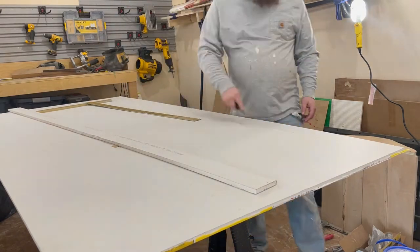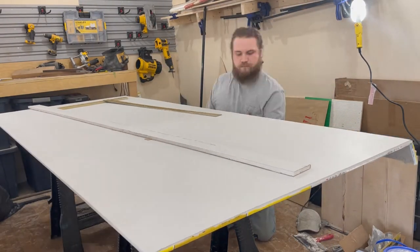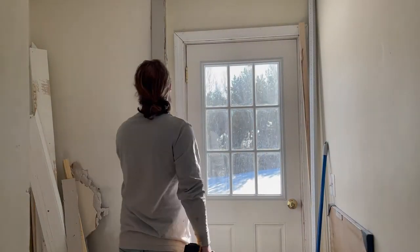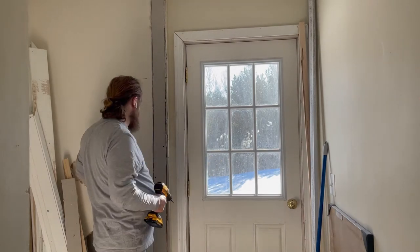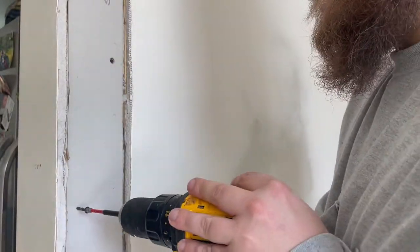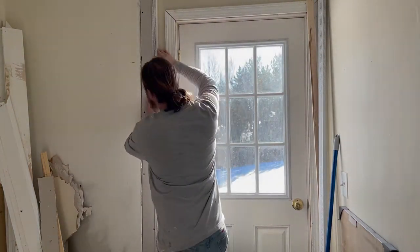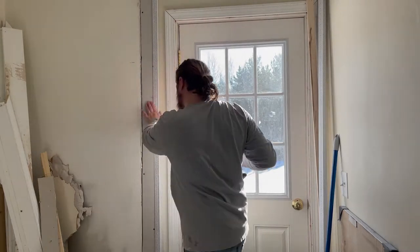Then cut the paper on the bottom side of your sheet, just follow the seam you created when breaking the sheet. I do this three times — once for each of the two pieces I need, and a third after I broke one trying to get it into place. Drywall is pretty flimsy and this happens a lot to me, so I always plan on it happening at least once. I use inch-and-a-half drywall screws to secure each piece into place. For the corners I like to use eight-foot vinyl corner bead, screwed in with the same inch-and-a-half screws, every eight to twelve inches on both sides of the corner.